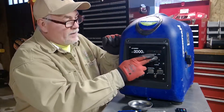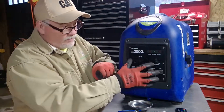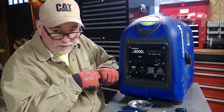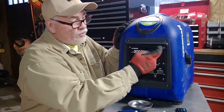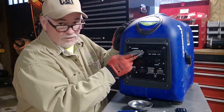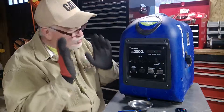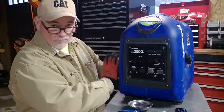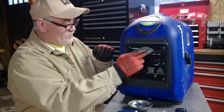I checked my breaker — that's good. I unplugged everything off this unit and took the power from the inverter itself while it's running and I'm still getting weak volts. My guess is it's the inverter, but all the research shows it's this CDI. So I'm going to try to change it. Maybe it's the CDI — I doubt it, but I'll be so impressed and happy because this only costs 60 bucks. The inverter, which I think it is, is like $275. So let's hope it's the CDI.